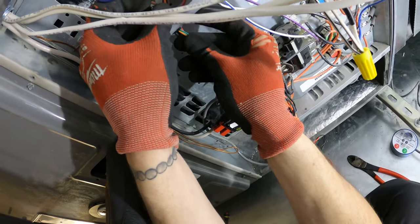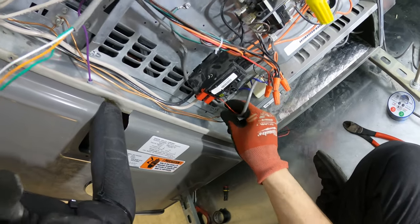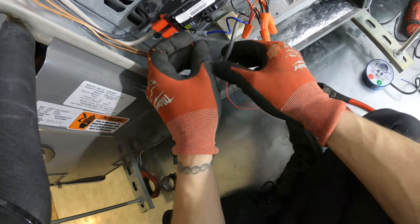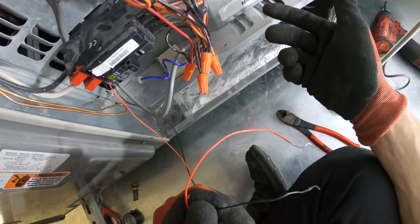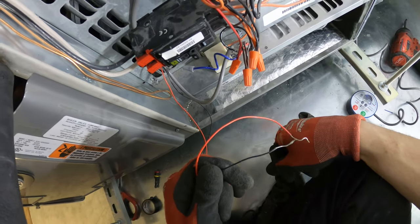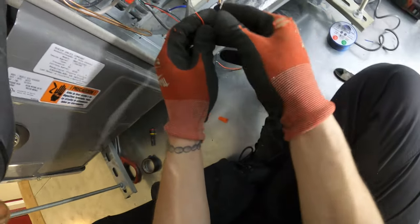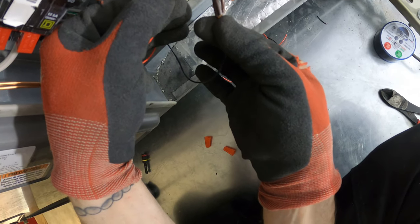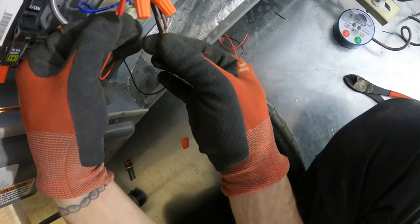So the contacts are gonna be up here, get connected on that side, but our 24 volts, which is the red and black, will be connected right here, as everything's already cut for me. So I'm just gonna pull back the wire nuts and put one wire on each end. So we're gonna cut back on the insulation on these wires and just put one on each end of that transformer. And now we have power to our wet switch, and then we can focus on the contacts.